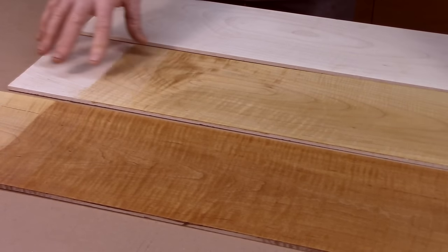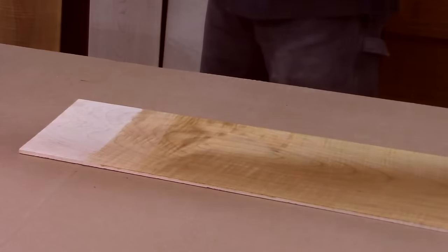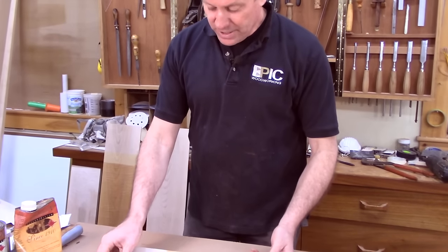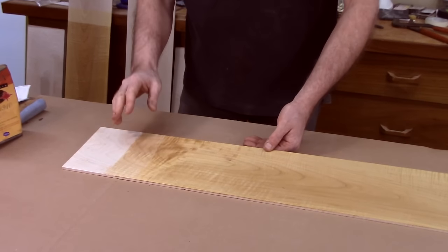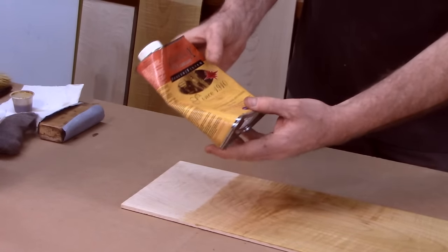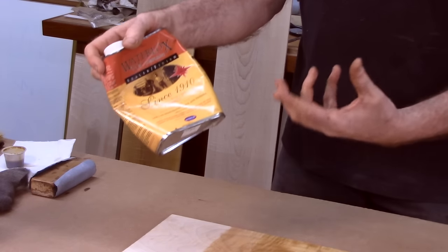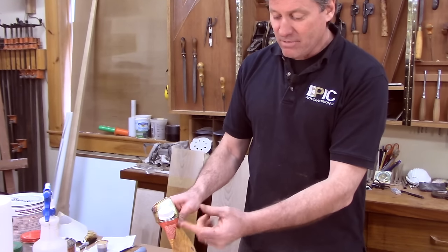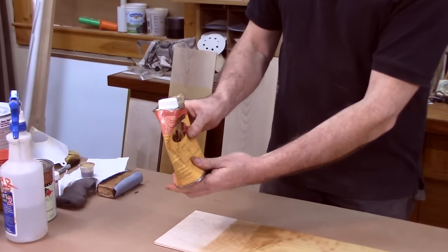Starting with this oil — this is probably the easiest finish you can apply. On this board, I've got steps here: the first coat and the second coat pulled down. You'll just read on the container. In this case I'm using Waterlox. You may wonder why I've got a dented can. I actually squeeze it after I've used it to squeeze all the air out and then tighten it with the liquid very close to the lid. That's the poor man's way of preserving finish.